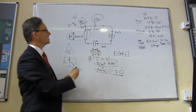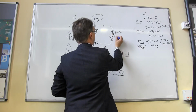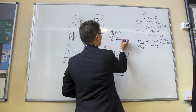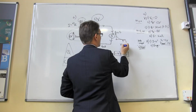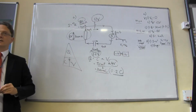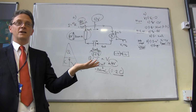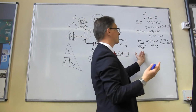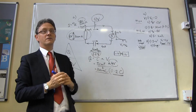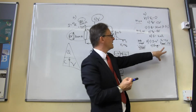And that's why the ammeter, if we drew a graph, it would look like that. Current against time will drop down to 0, okay? If you've got this little sketch graph, that point there happens when the voltage on the capacitor equals the voltage on the battery. All right. Once that happens, exam boards say it's fully charged, fairly useless statement. The point is it's fully voltaged. It's now matching the battery voltage, and therefore there's no current flowing. Okay. Everybody, look at that.